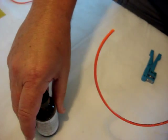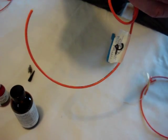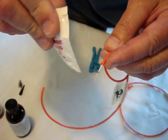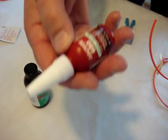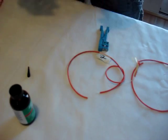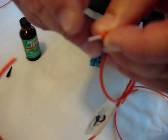What's our next step? Most important — we're going to glue it. So the first thing we're going to do is wash this with our alcohol wipes, wipe it down. Then we're going to take what we call our Loctite — this is our glue — and put about two drops in here. Let it sit over here on our board. Then we're going to take our primer and run it along this fiber.